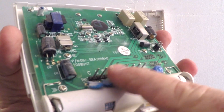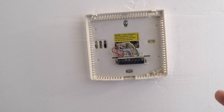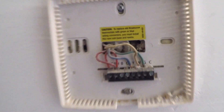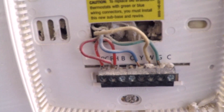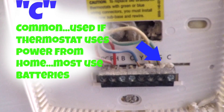I'm just showing you here how I pulled that off. There are the pins that connect into the wires coming from the unit itself. I've got four wires: a green, white, blue, and red wire. There's not a fifth wire, and if you don't have that fifth wire, you are going to need the extender. The C terminal has no wire going to it.